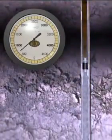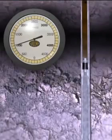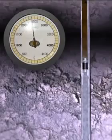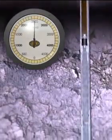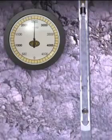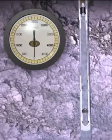Displacement continues as cement is pumped out the liner shoe and up the annulus. As the plugs near the landing collar, the pump rate will be slowed again, and the bump will be observed by the increase in pressure. When we are comfortable that the plugs are holding tightly, the pressure is bled off, and we check to see that there is no backflow through the float valves as the heavier cement tries to U-tube back inside the liner.